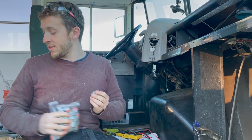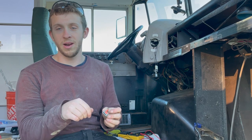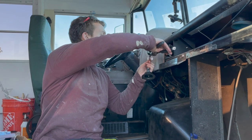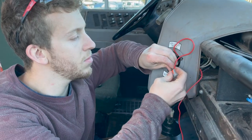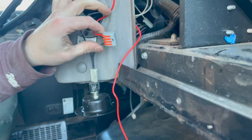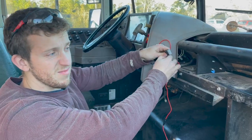There are two ways to connect multiple wires together - since we're connecting three wires, I love these little lever connectors. You just flip them open, stick the wire in, and close it. They're amazing but not waterproof, so don't use them outside. I'm going to snip and strip the wires and stick them all into the same connector. And that's it - now they're connected. Last step, I just like to tape everything together with electrical tape so the wires can't go anywhere or bounce out.